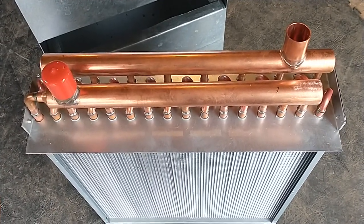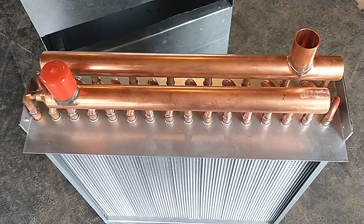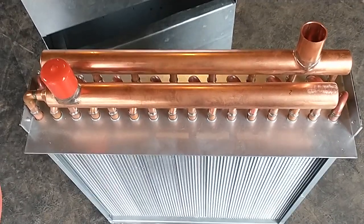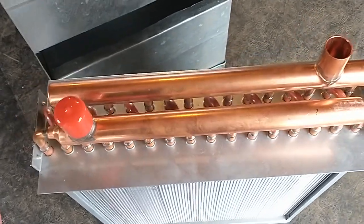Hello folks, I thought I would explain how a hot air coil or forced air hot water coil works, what it looks like, and how to mount it into the ductwork. First I'll describe the coil — basically a hot water coil is just two manifolds, a supply and return.